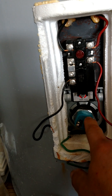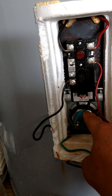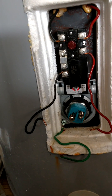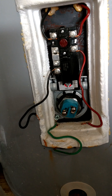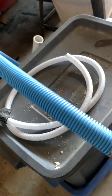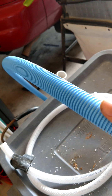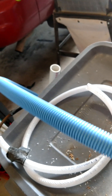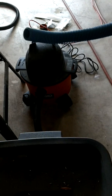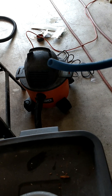You take this heating element out, then go inside with a hose from a wet-dry vac and do your best to get all the calcium buildup out. I built a special hose — it's conduit-type tubing used in electrical work. I picked it because it's very stiff, so I can maneuver and form it to get the angles needed inside the water heater.